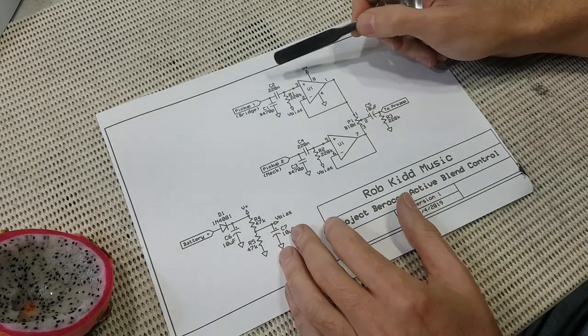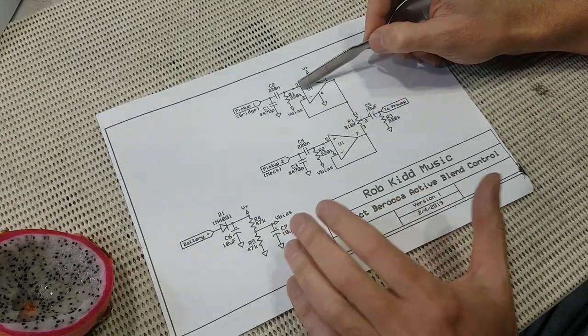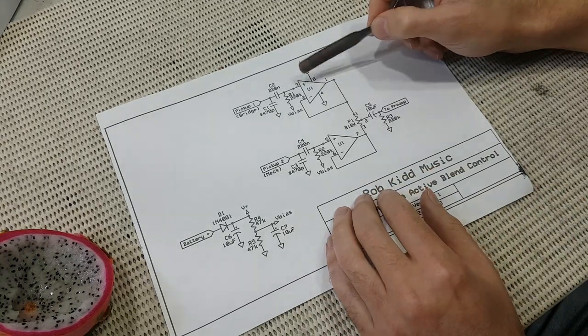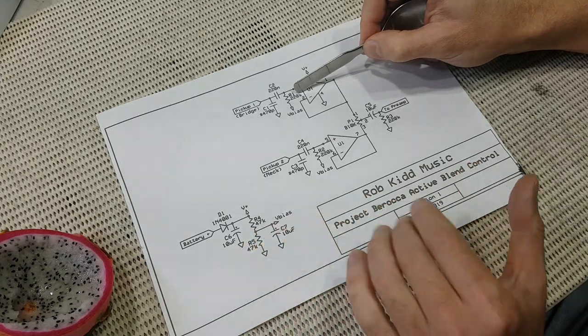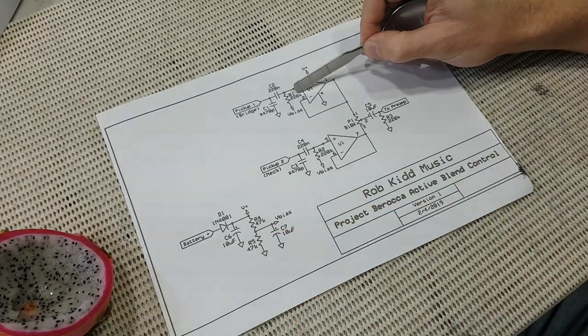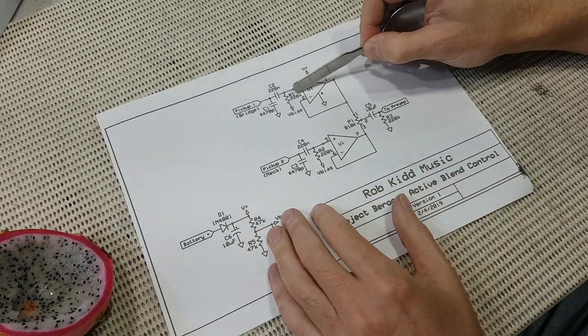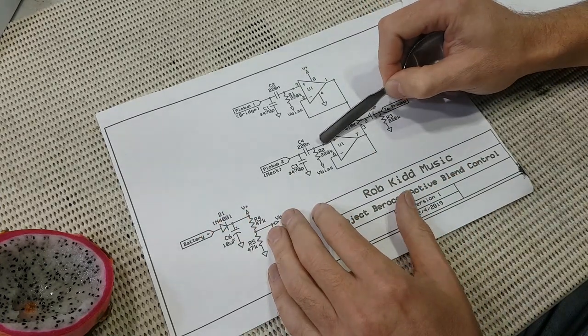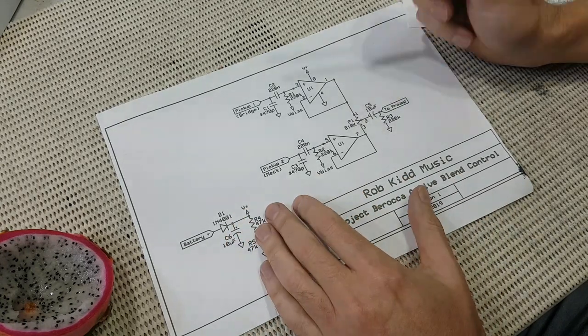C2 and C4, these are coupling caps. R1 and R2, these are quite important. These actually set the input impedance for each buffer. It's most likely I'll set R1 to 100k, because if memory serves, that's the input impedance of the original 1970s Stingray preamp. R2, well, I'm not sure yet. I'll be testing the pickups and choosing these parts in the next video.